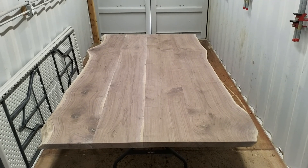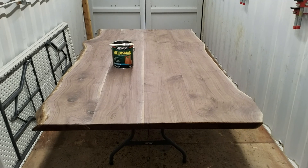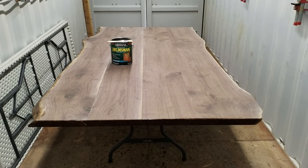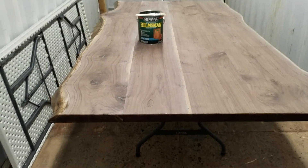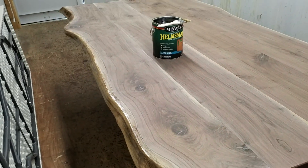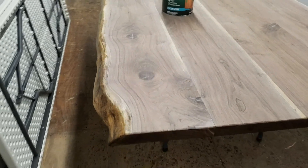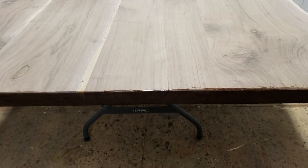Before I proceed with the top, it's very important that on the very first coat you put onto the table, you do the end grain on the end of the table and also the edge of the table. If it drips over onto the edge with the open grain, it'll leave a permanent run stain down the edge. So you first want to coat the end grain of the table and the sides.